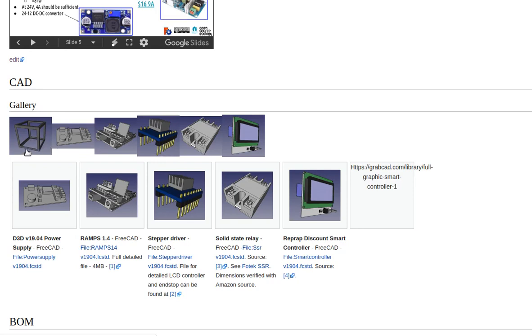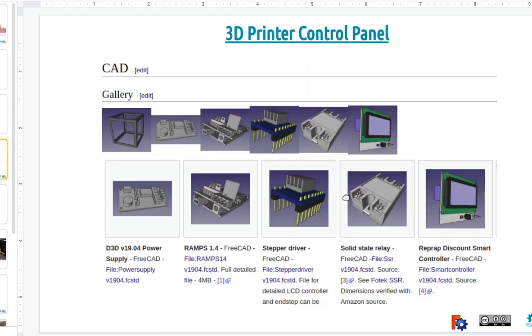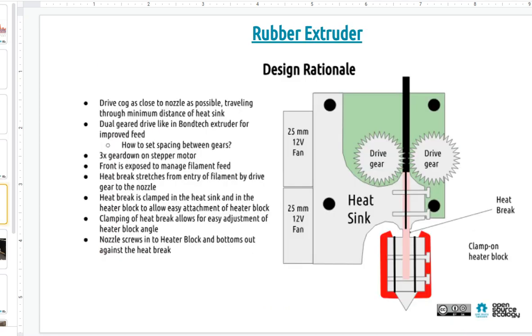How do you do a 10-inch heated bed on an 8-inch bed? Well, one way to do it is stand it up vertically and do it across the long way, basically diagonally on a heated bed. So we can print up to 1.4 times 8, so about 12 inches of length if you print diagonally on an 8-inch bed. So we can still print that on an 8-inch printer, even with the control panel being about 10 inches. So that's that. So yeah, 3D printed control panel, putting that all into CAD, so it should be all updated. Hopefully I'll have that by next time.